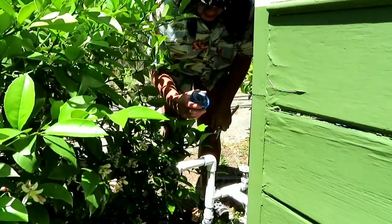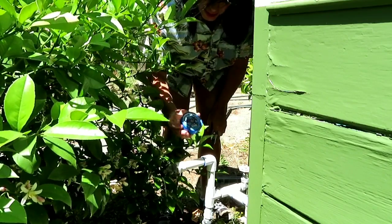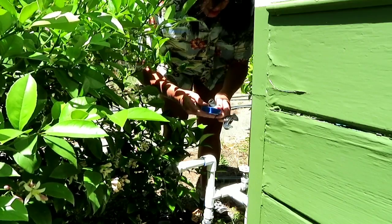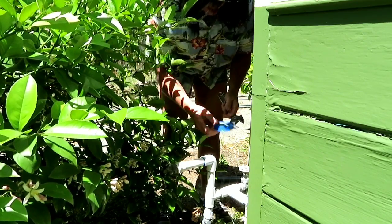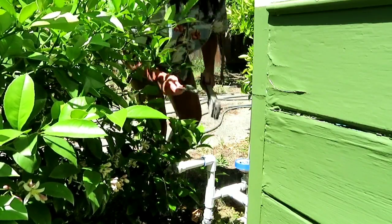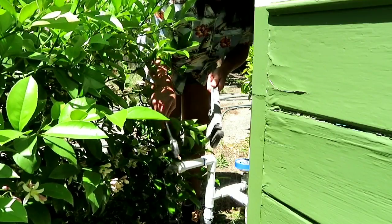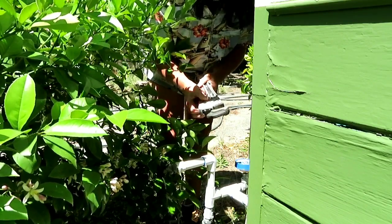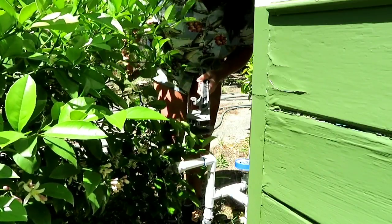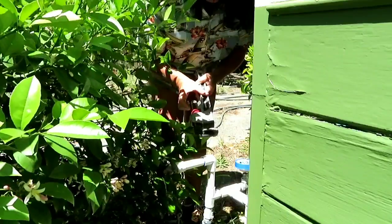You are going to need some pipe thread tape, and I really like the Blue Monster stuff. It's slightly thicker. We're going to wrap our connection when we put our new one on. So we'll set that aside. Make sure your water's turned off. This is going to require 2 wrenches. I don't want to just get in here and turn this faucet bib too aggressively, because I might snap off the pipe connection here.